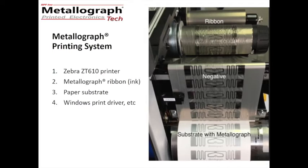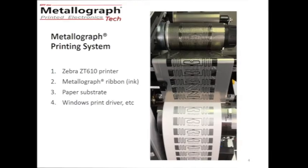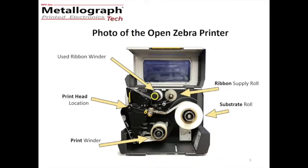The Windows print driver is what is embedded in the computer and runs the printer. Here is a side view of that same printer. Here is the device itself, and the key point is where the print head is. However, all of these other parts that you see are necessary. We have a roll of substrate — in this instance, it's a four inch wide material. It comes down and is pulled through the machine by a drive roll located here. In our instance, we are winding it up on another core, so this is where the print product will accumulate.